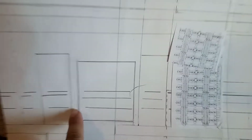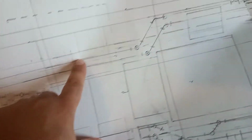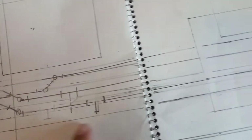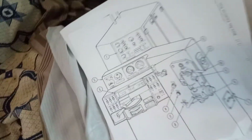And then it goes past underneath into the engine cabs, and then splits over here to your cutout cocks on the sides. Then it runs into your main and equalizer reservoir, air brake, air compressor. Then back into the final cab, where here's your air brake control stand, and there's your locomotive control stand. And then you can see the air piping schematic down there.